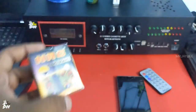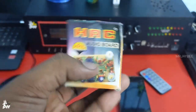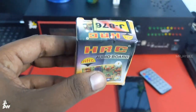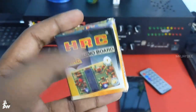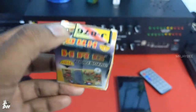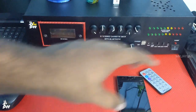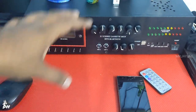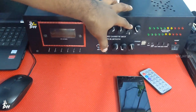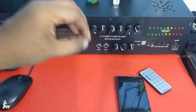This is actually an old one, made by HRC — the Harajinda Radio Corporation. This board was used in almost all cassette decks by technicians to increase the bass. Today we will be installing this board as a pre-bass-treble board alongside the existing bass-treble board on this amplifier. So we will have two bass-treble boards: one is preset and the other can be adjusted manually as the user wishes. After installing this board, there will be much more bass, a cut in the vocal, and a flat voice coming through the amplifier.